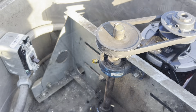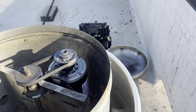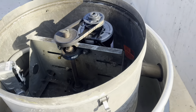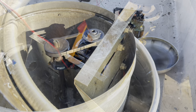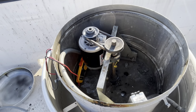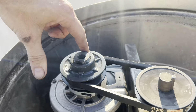I'm going to turn this off, we're going to go turn the breaker on. It's pulling nine amps — I gotta check the tag, I think that's too much. Yeah, it's pulling nine amps and that's too much; this one's allowed to pull 7.2. So I've got to open up the pulley.